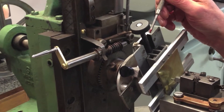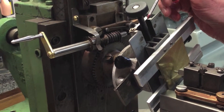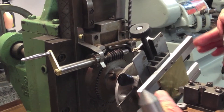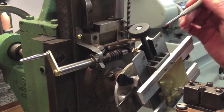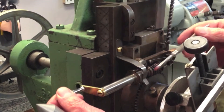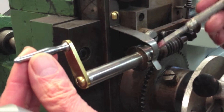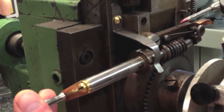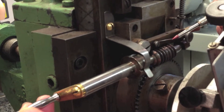This is a new Hermes chuck for a pantograph. I like it because it's inexpensive — I paid about a hundred dollars for it — and it moves in two different directions. You can put any type of aluminum jaws in there to hold just about anything, so it's a real nice adaptation to this machine. You'll also notice there's a detent here with four marks on it, and that's where all your patterns are designed from. It's just a worm gear, very inexpensively made right in here, as opposed to a straight-line machine.